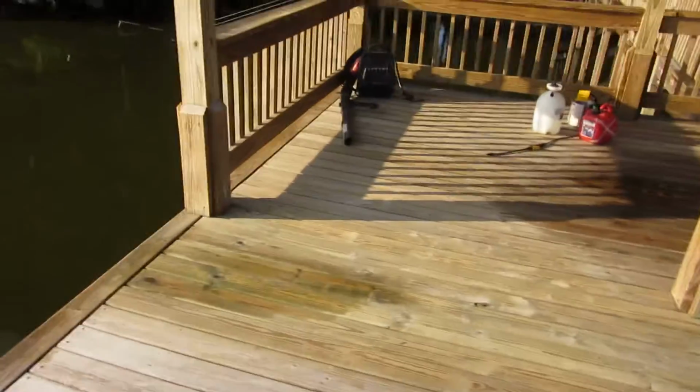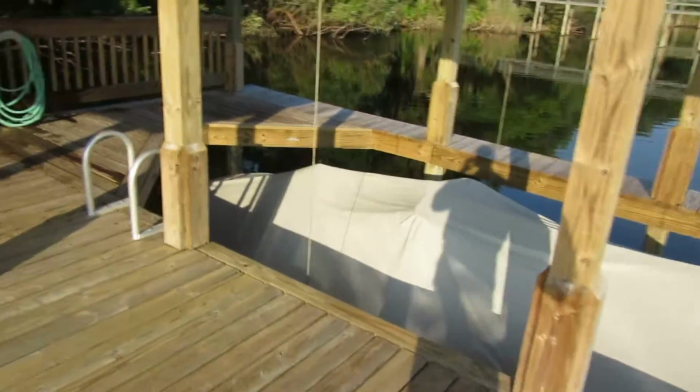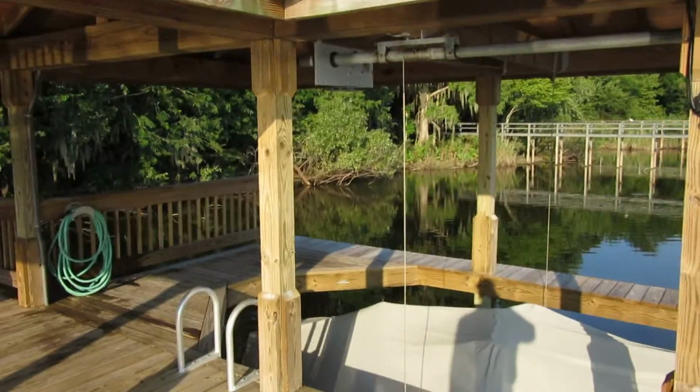If you put wood underneath the microscope, which obviously we're not going to, but I've seen it since I studied wood chemistry, and then you put water on it, it's really crazy. As soon as you pour the water on it, you'll see under the microscope the pores open up super wide. That's what you're looking for before you stain.